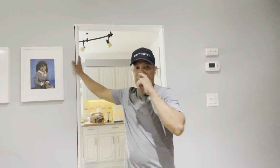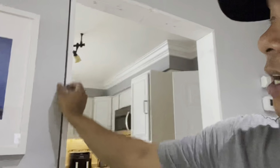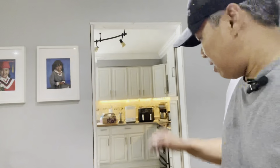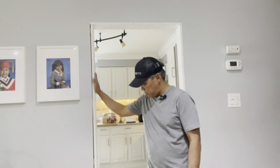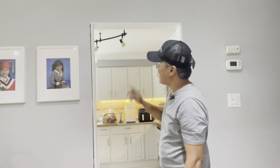This time I already plumbed this board here, which I already shimmed. You can see this gap in here. I already shimmed it from the bottom, and it's already squared both sides. So that's very important on how to square the door jamb, or the entryway jamb. That's what I call it, to accomplish that perfect square jamb. So right now we're already ready to nail those trim boards we have all the way around,